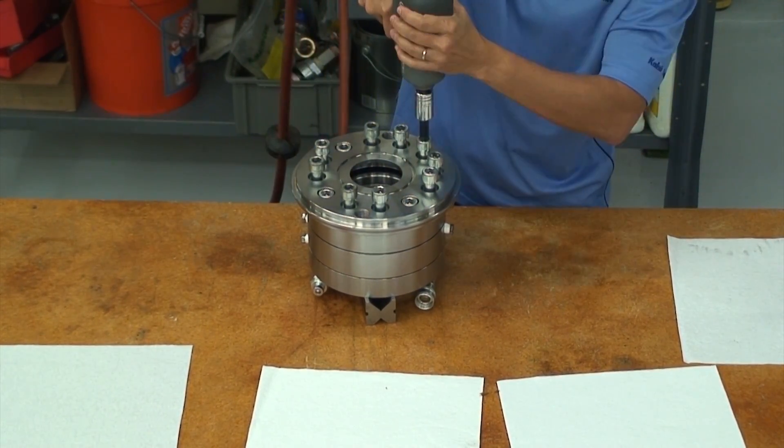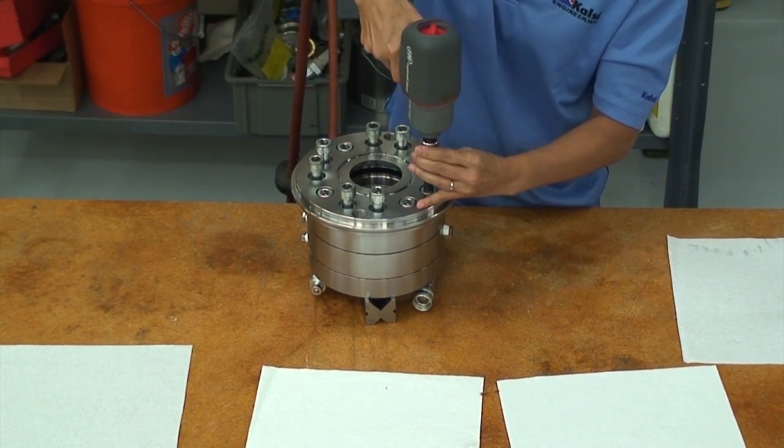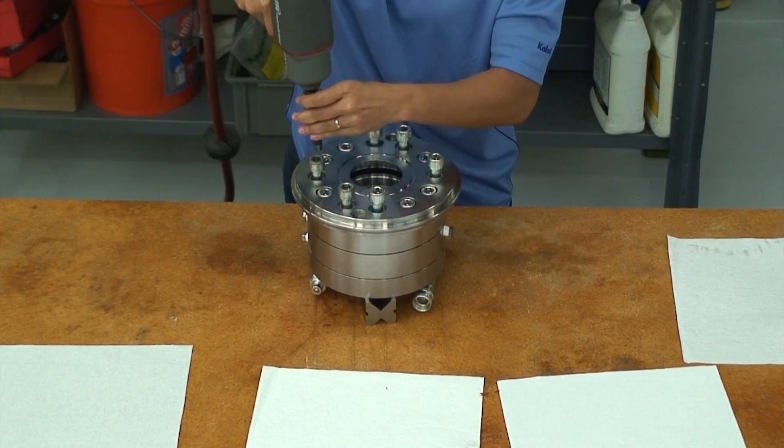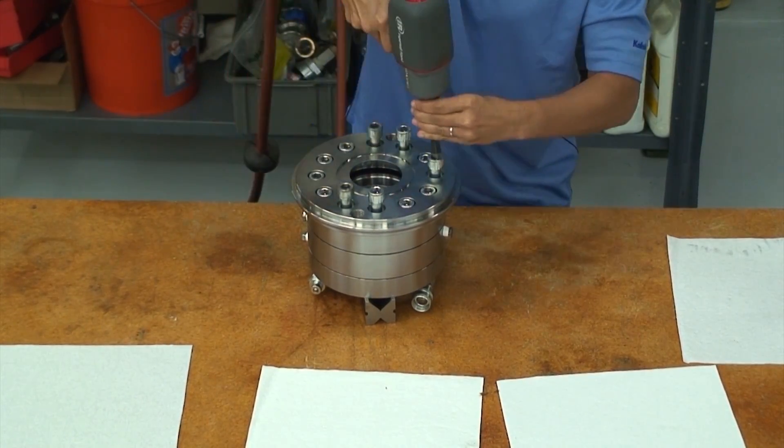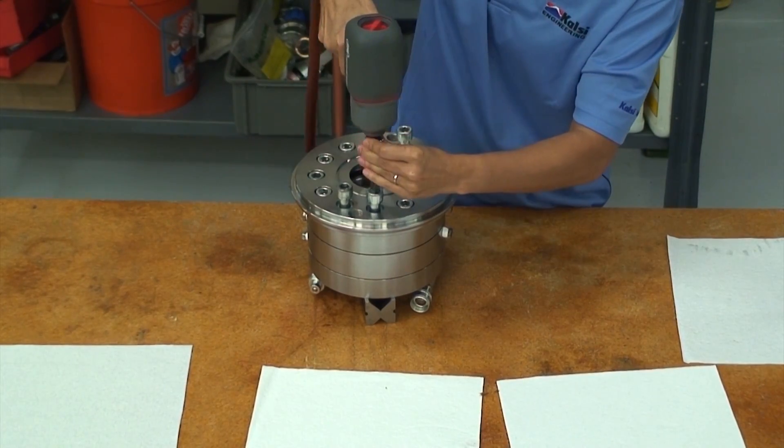Each pressure stage of the wash pipe assembly has a 7500 psi dynamic sealing capacity. See our 1,000 hour 7500 psi rotary seal test YouTube video. Chapter C16 of our handbook summarizes testing performed with the plastic lined seal and floating backup ring.